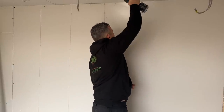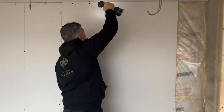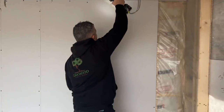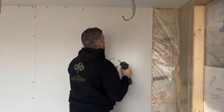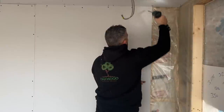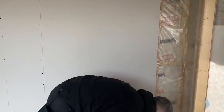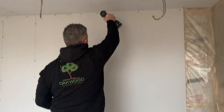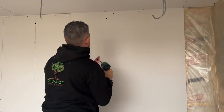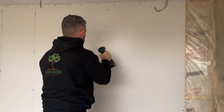I've got a timber straight away at the top of the head of the wall — get them in along there. I've got a good nice joint on that board. I've marked these studs as you can see. Generally if you look where the line is you can gauge where it is — if you miss one you'll just pull the screw to the side.